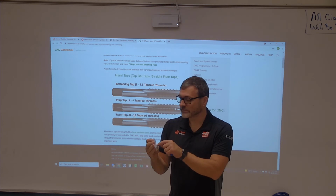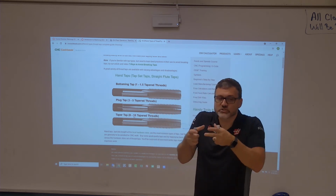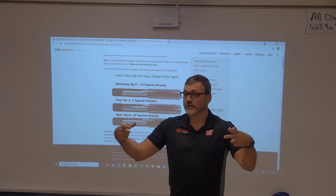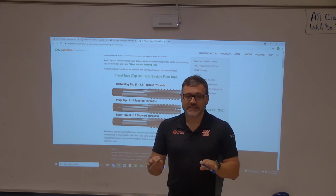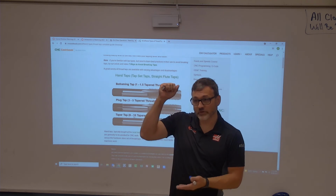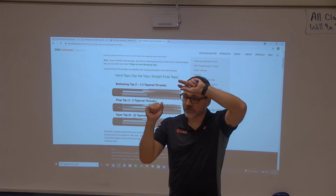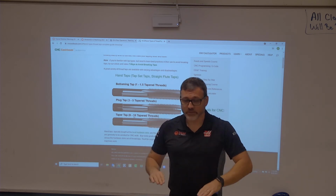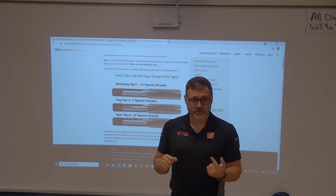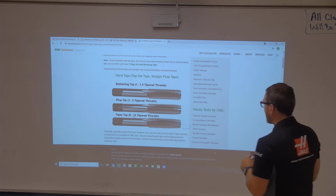The only other problem I really saw in this part is at the bottom of this counter bore, there's chatter. That happens because you've got so much effective area of the tool touching at one time. The larger the area that it's affecting, the more it's going to cause some type of chatter or vibration. The easiest thing to do is adjust your RPM. Two different things can happen. When you get to the bottom of the hole, if you're using a stop, let it sit there for a second and dwell. Another way is, since the drill presses have variable RPM, adjust that RPM. Slowing down or speeding up, but not super fast, will oftentimes remove the chatter. You want a nice smooth bottom on there. Nobody wants a bumpy bottom.